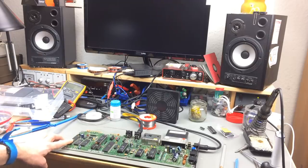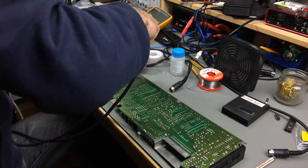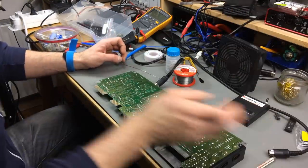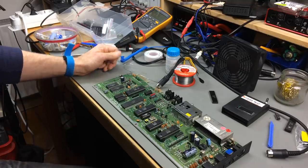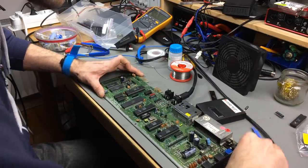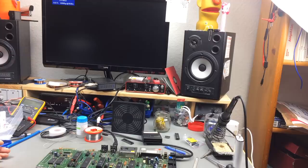I'm just going to desolder the second CIA chip now. Yeah. Let's go! This is like a soldering tutorial, really. Let's see if it works without the CIA chip. Maybe that was shorted. It should do something at least. Okay. RAM. Maybe the RAM is completely shot. I am going to try to put new capacitors in, I think.